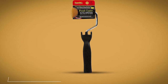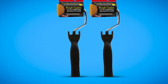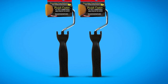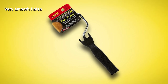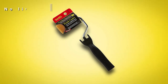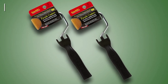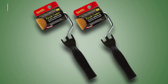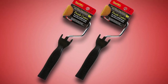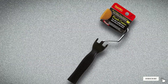The number six position is dominated by the Foam Pro Finish Coater 2-inch Roller. If you've assumed that painting trim requires an angled trim brush, you'll be happy to know you have options. This roller is made of high-density foam that lays down a beautifully smooth coat of latex paint without brush strokes, lint, blotches, or other imperfections. It's perfect for painting trim, moldings, door frames, tight stretches of wall, fence posts, furniture, or crafts. The foam glides easily over smooth surfaces including drywall, wood, and metal, and while it can be cleaned for reuse, it's reasonably priced enough to discard after one job.